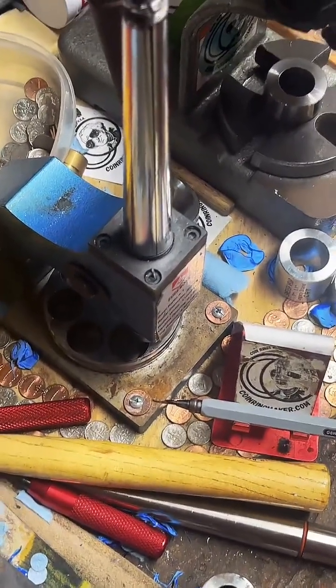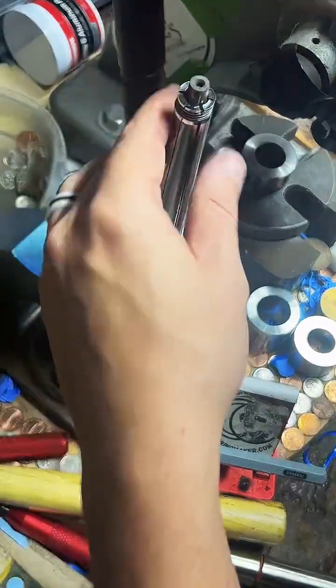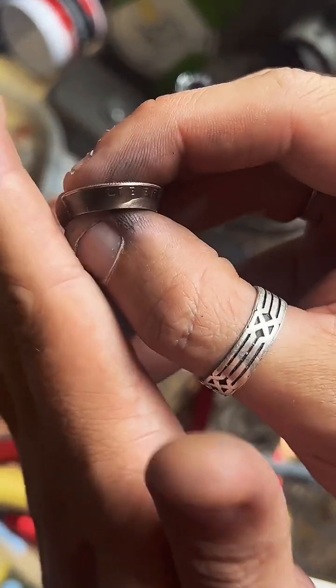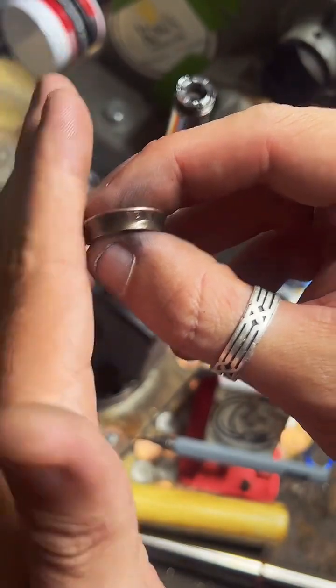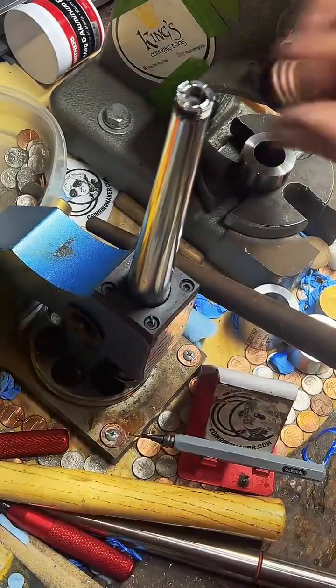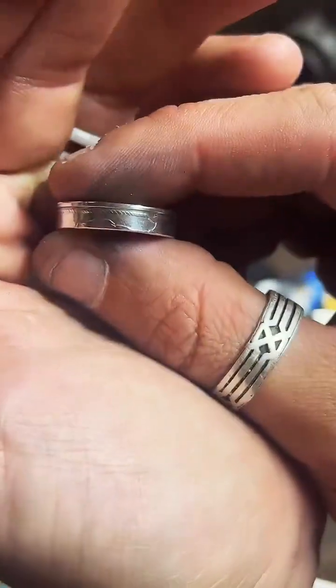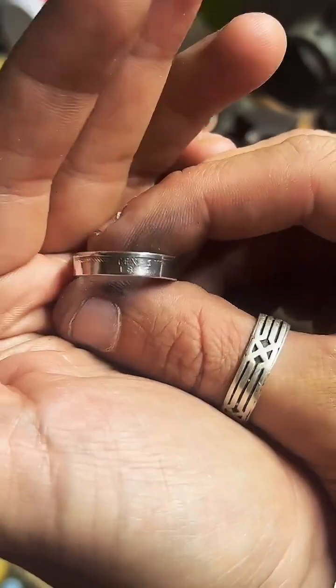Wouldn't stretching the coin like that make it thinner at the top than the bottom? So that's why I stretch one size over what the customer requests. When you stretch on the stretcher, it does leave kind of a cone shape. So I go one size over, and then I reduce the side that's a little wider. And that's how we get this nice straight wall. Pretty.